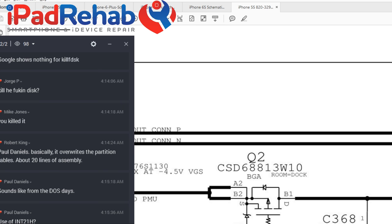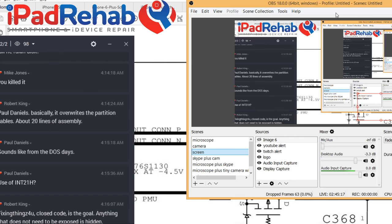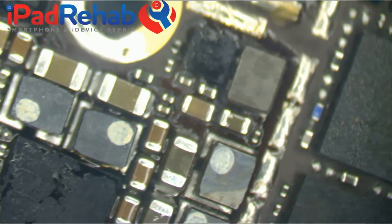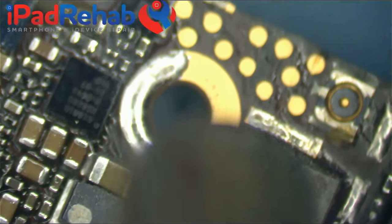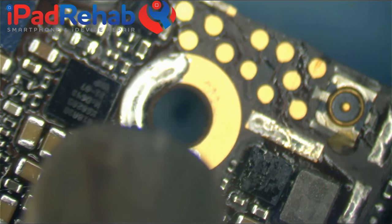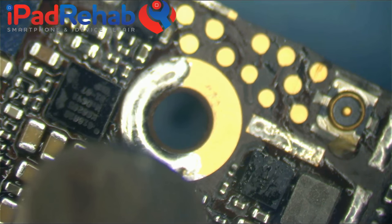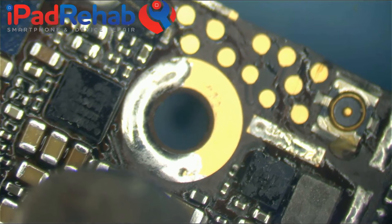I'm trying to think, like, if there's any theory. Maybe you guys can come up with one. Is there any theory where a simple open line on 3V0 accessory would cause any kind of problem? I can't think of anything. You know, like software corruption. Software corruption is not going to make it pull zero. That is total, like, open line somewhere between the charger. Even, like, a bad chip, that kind of thing pulls something.